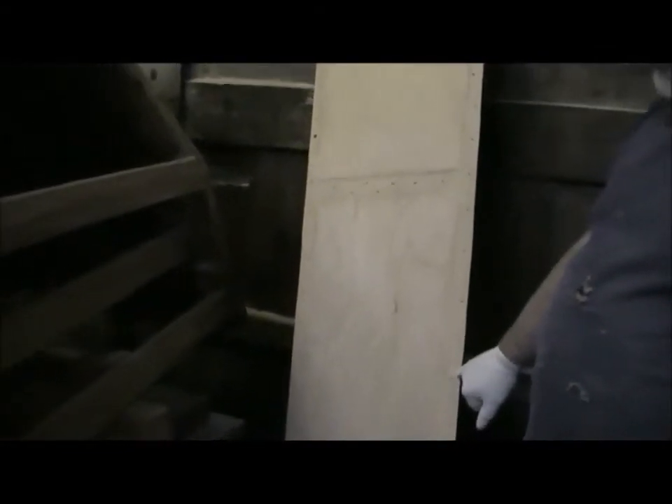The next thing we're going to do is glue down these edges. Now, these edges have been pre-drilled, and the reason for this is two-fold. Firstly, I don't want any air pockets underneath and I don't want any big lots of epoxy building up - I want it squirting out. The second thing is, as these go through and get cleaned up on the face side, once they start to dry and cure up, we then end up with basically epoxy nails.